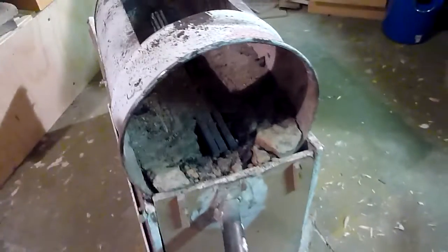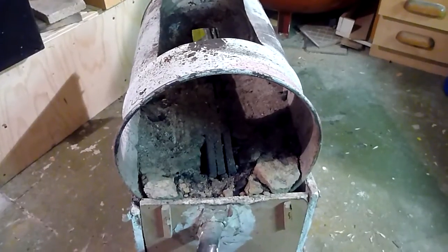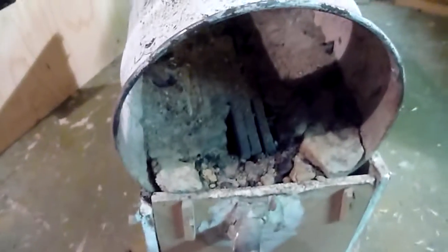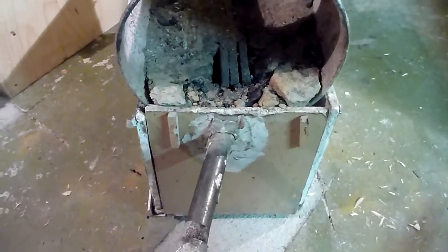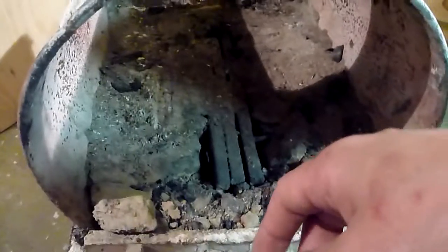Hello guys. I've constructed this one out of a big paint can, empty paint can, about two and a half years ago, and it has been working pretty well. But as you can see, the clay here starts crumbling really badly. And also, what you see here sticking out on the front — this is where I was connecting the blower. It's the forced air intake. This setup was okay so far, but it started giving me a bit of a problem. The biggest problem is that this consumes too much charcoal. There's so much wasting space here, and the burning area is too big for most of the time.